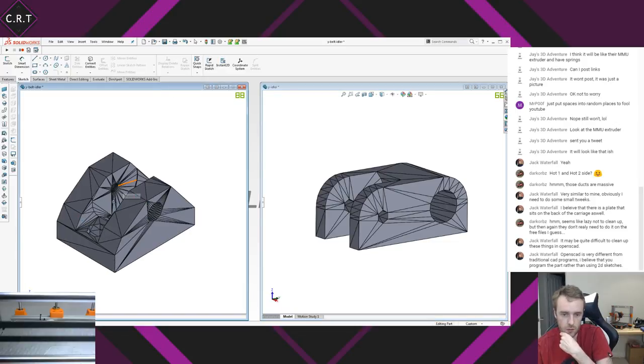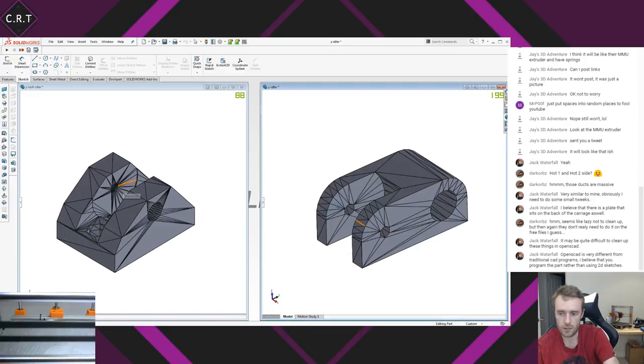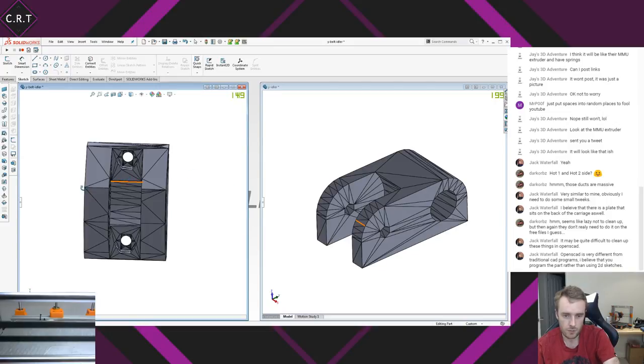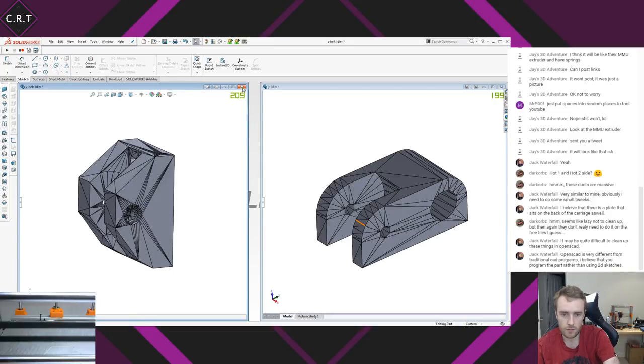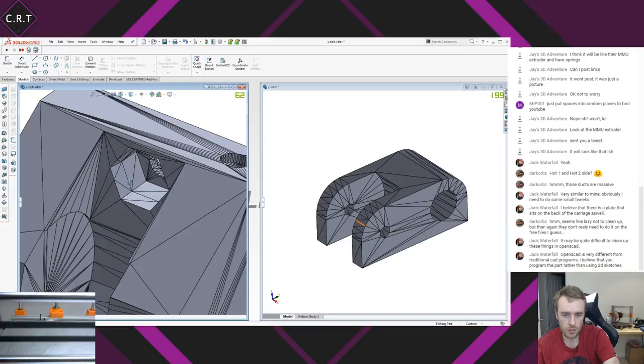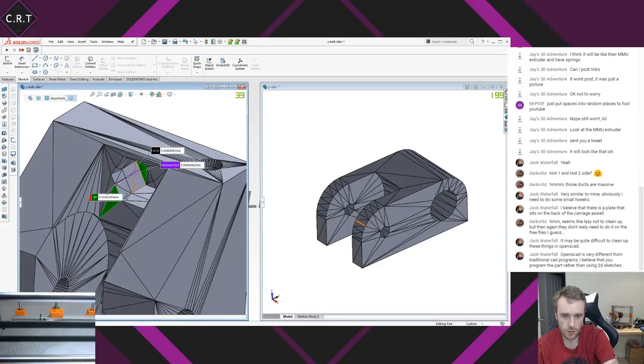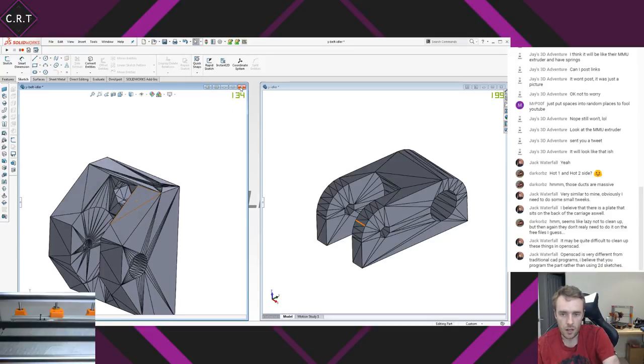Probably more sturdy. This one's not going to have the sort of wobbliness that this one could. You could sort of rotate it up and down. Having the two M8 nuts just crush it in the middle was not particularly great. I think this one will sit rather nicely. But judging by the depth of these holes, they've considered nylock nuts because they're about 4.5 mil deep, and those holes are 5 mil deep. So that's a good thing. Always nice to see nylock nuts where you can.